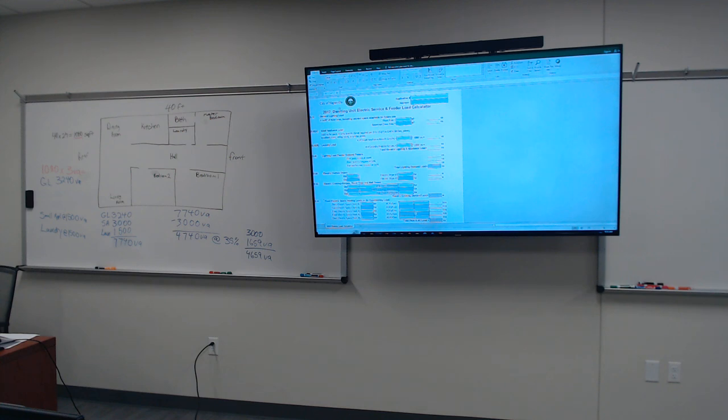Okay, so our floor area, and when you hover over it, it tells you 220.12, lighting load for a specific occupancy, right? We have a total of 1,080. Okay, so look at that, it says 3240. So we're on the right track right now, 3240. All right, good.